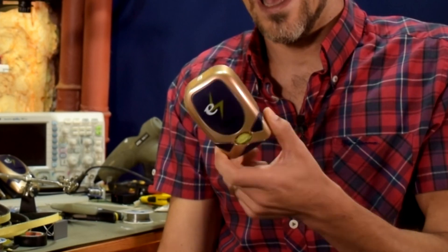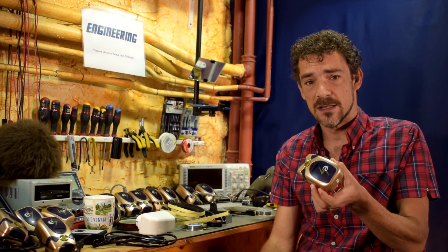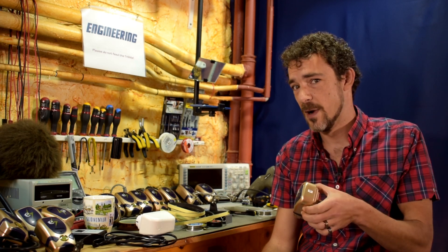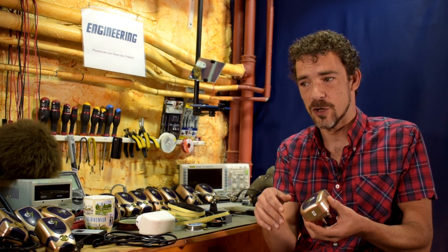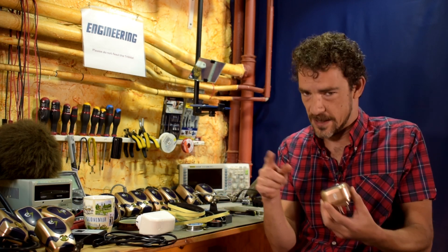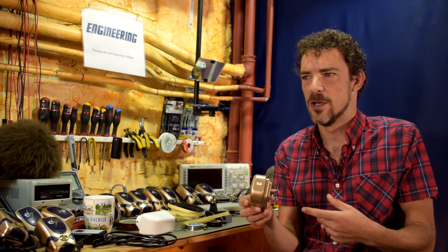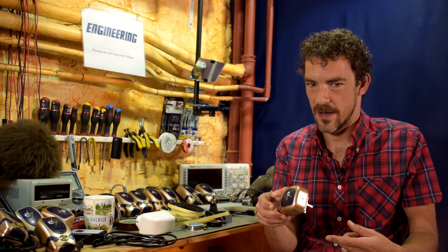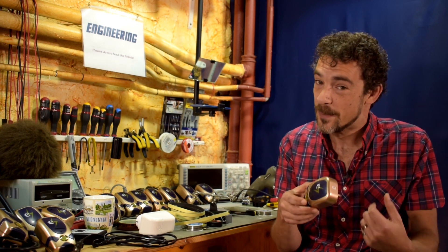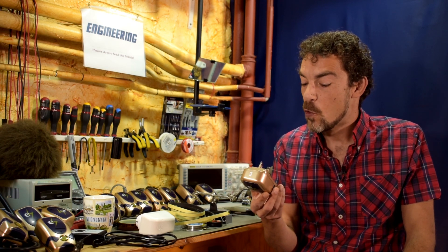What I wanted was to duplicate the commercial filter's form factor, so I bought a bunch of these — they're called power factor savers. This one has a UK plug; I'll talk about that in a second. You're supposed to plug these into outlets in your house and they're supposed to save you money on your electricity bill. What they actually do is put a capacitor across live and neutral, which can improve power factor in certain circumstances, but they're not actually going to save you any money because you are not billed for apparent power — you're only billed for real power, i.e., volts times amps. So for saving money on your electricity bill, these things are totally and utterly useless.